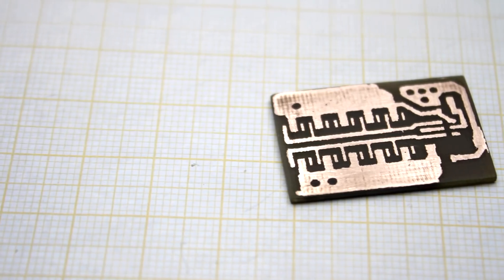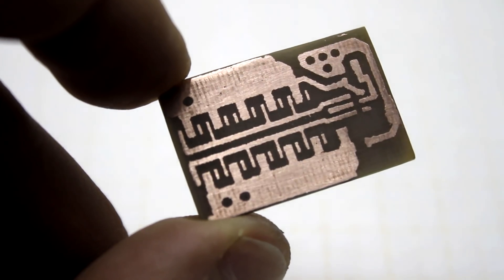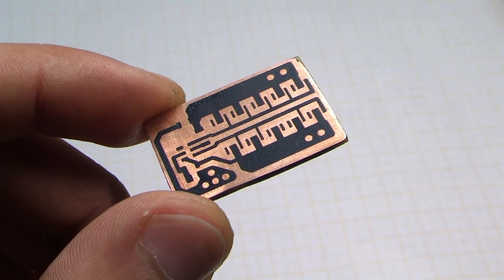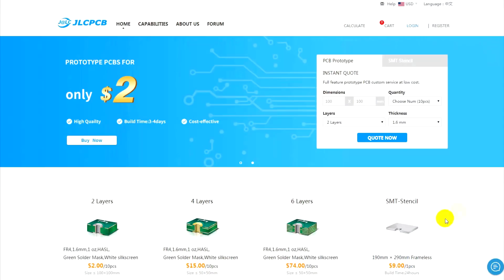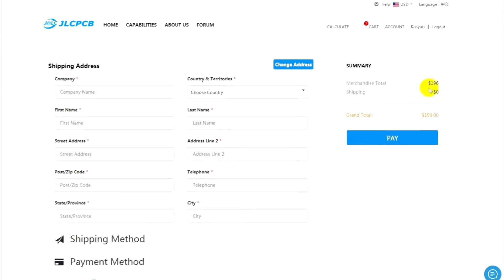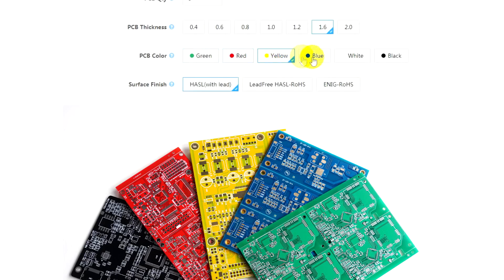This took me a long time. I had to manually draw some components to size according to datasheets, because in my fairly extensive library of macros the necessary components weren't found. In the end, the board turned out to be rather compact. The thickness of some contacts is only half a millimeter. The finished board shows that such a task is difficult for laser-etching technology of creating printed circuit boards. In order not to bother with homemade PCB technologies, I advise the service of JLCPCB — the leading factory which manufactures printed circuit boards of any complexity, sizes, and shapes from your Gerber format files. There is free shipping on the first order, and prices start from $2 for 10 pieces. A link to JLCPCB can be found in the description.